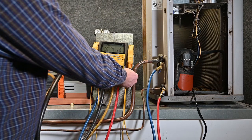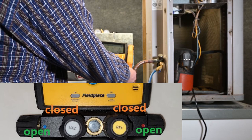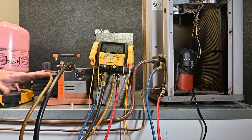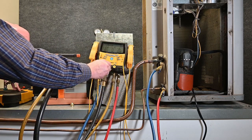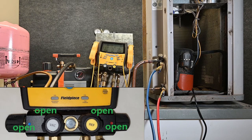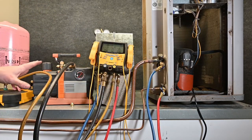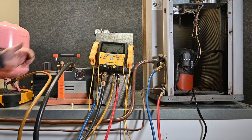What we're going to do next is make sure we open our high side and low side valves. Our high side valve is already open, so we'll make sure it's completely open. We'll also open our refrigerant valve and leave that open as well — now all three hoses, the blue, red, and yellow all the way to our tank are connected. But we also need to pull a vacuum through all of this. I'm going to open up the vacuum side so now all four hoses are connected. I like to start this process by closing off the two valves at our unit, so when I first pull a vacuum I'm pulling right here at my micron gauge. Making sure the port is tight and all connections are snug, we're going to start our vacuum pump.